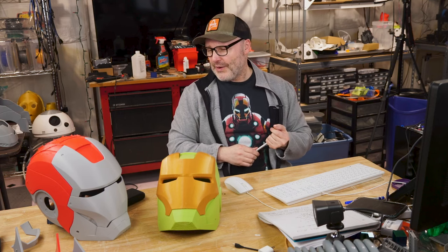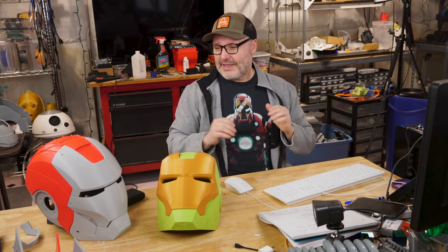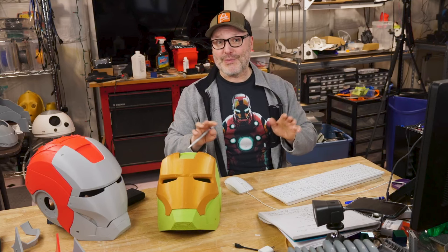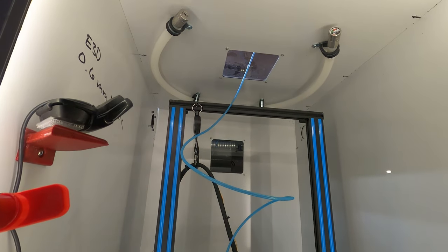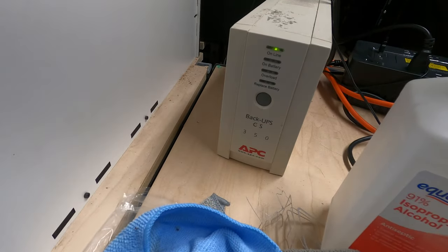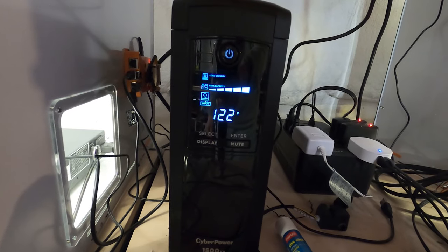I also want to talk about print safety, because some of these helmet prints took well over a day — some took two days. I'm not going to tell you what to do, but I'll give suggestions. I print in enclosures, I have a fire suppression device in there, I monitor VOCs, and I have an air purifier. Some things are even simpler — like putting the 3D printer on a battery backup UPS, because where I live we get those flickers every now and then. A modest UPS can keep the printer running for a good 15–20 minutes.